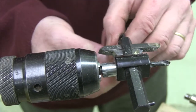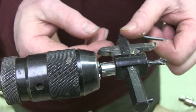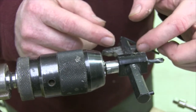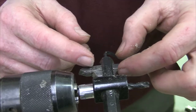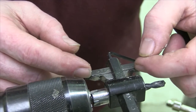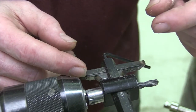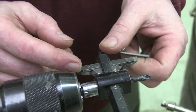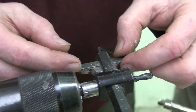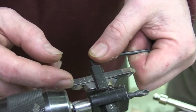Those two spacers you need measured with the calipers to give you what you want. Yep, you have the two quarter-inch ones, because you need to be able to swap them a full quarter inch. And then the middle one gives you that extra space that you need for cutting threads. If you take out the middle spacer and use it on one side and then the other, it would just make a tight-fitting box lid.